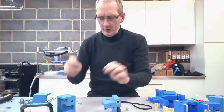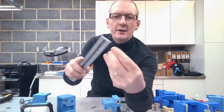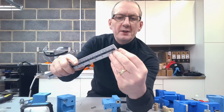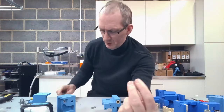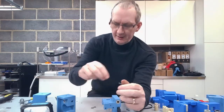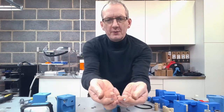To assemble that we're going to require an M3 bolt. Most things we use are all M3, and the size of the thread on this bolt is approximately 22 millimeters — so you're looking at an M3 bolt with 22 millimeters of thread. We're then going to need an M3 nut and also two little M3 washers.